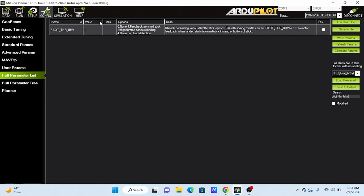Now to test the failsafe. Mission Planner has a feature that if the gamepad is accidentally pulled off the PC, it will activate a failsafe and prompt the drone to RTL, as can be seen after we unplug the gamepad.